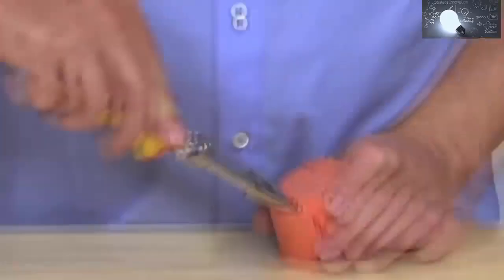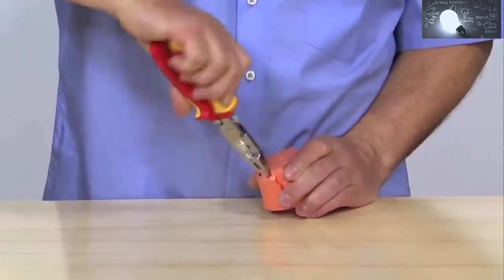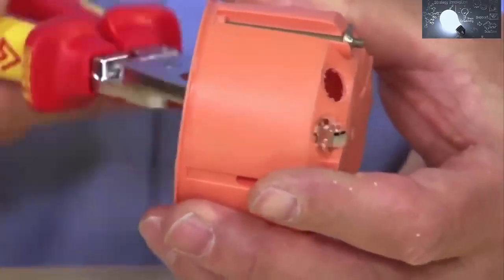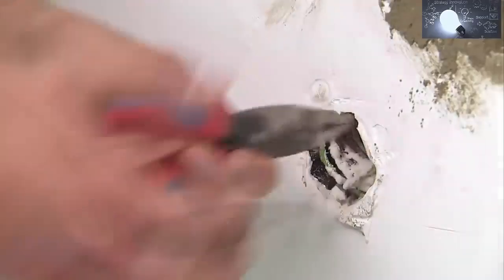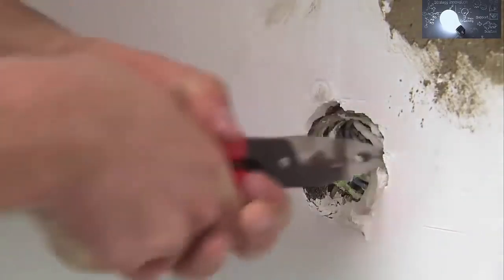The head of the installation pliers has clear-cut outside edges. These are used, for example, for piercing, deburring, and expanding openings in molded fittings. The edges of the pliers' head are also used for a number of other scraping and cleaning operations, for which, very often, no suitable tool is at hand.